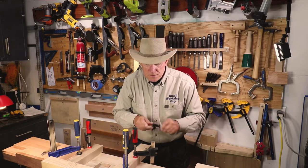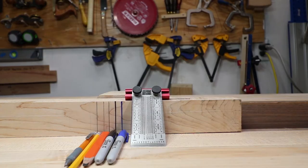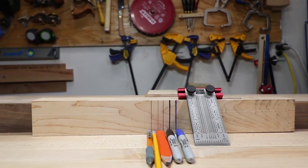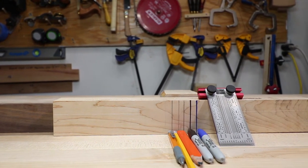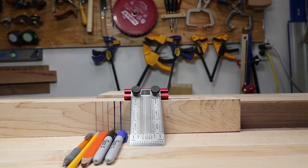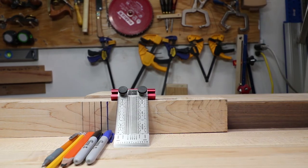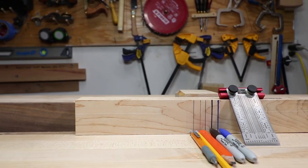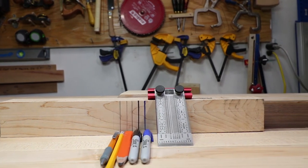My question is: is that ink soaking down into the grain? I'm wondering whether or not using these sharpies is a mistake — am I creating more work for myself getting that back off my work piece before I put on my finish? So now to test this, I'm going to run a sander for a while over all of those marks with equal pressure and see in what order they erase.